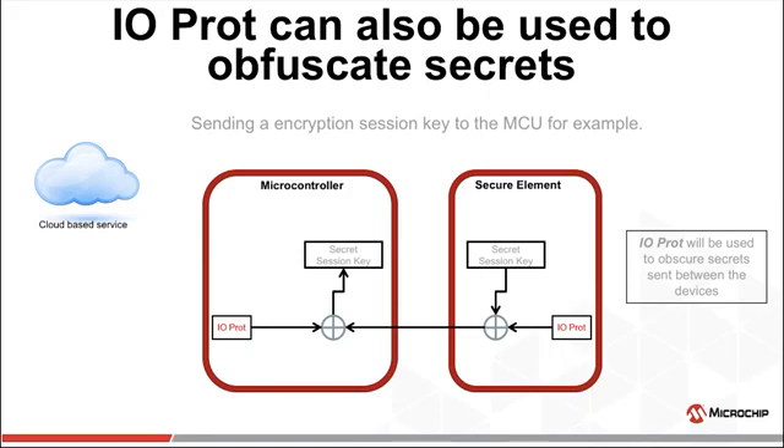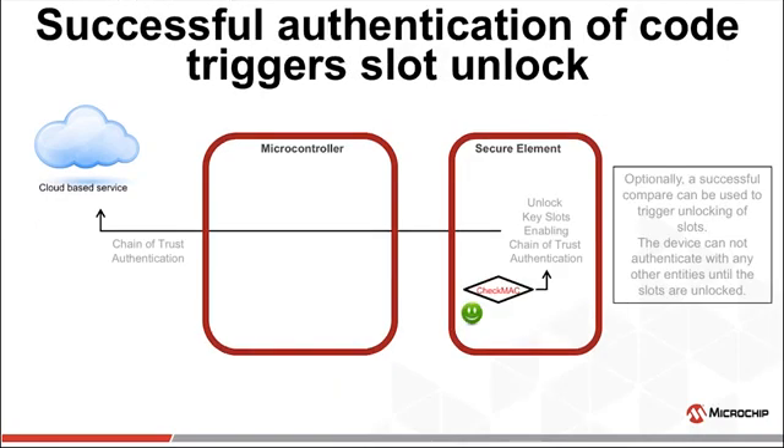The crypto element is inherently secure, but not so much the microcontroller. It is still possible for a hacker to literally take the entire microcontroller off and put a new one, rendering the crypto element irrelevant. We can limit hacks to a single device in physical possession of the hacker, but we still want to make life as difficult as possible. We can add more height to that security hurdle by locking the keys and credentials needed for cloud service access in the crypto element, and only allowing them to be unlocked after a successful authentication — thereby forcing the use of the crypto element.